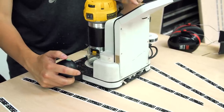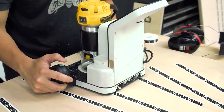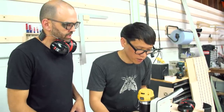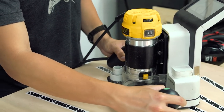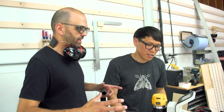I can see now what I've drawn — that T is on there. I'm in the pen tool, so I'm just creating anchors. I press the green button to create a point, then move and place points. Can you do curves this way as well? Not yet, but that's coming soon. If I want to do something more curved, I just add more points, and hit my origin to close the shape. We also have the ability within here, without changing the diameter of the bit, to actually dial in offsets. It's almost like adding a stroke to the outside of the vector — you're basically just offsetting the path of where you want to cut, and you can expand either inside or outside of what you're doing.